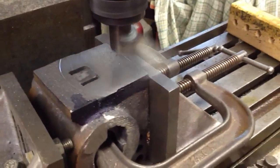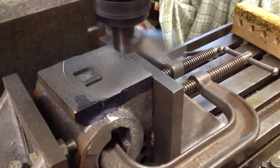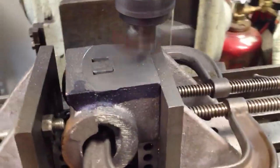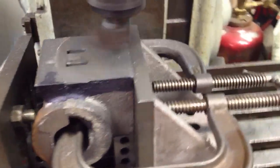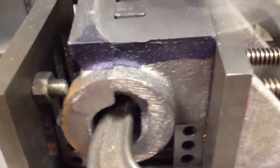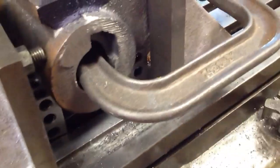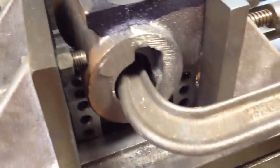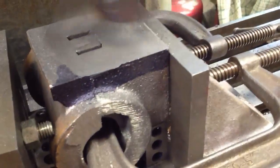I'm machining the top side of the cylinder. This is an Allen Models of Michigan cylinder casting, just mounted up, clamped on a block leveled up. C-clamp holding through the bore, using this other angle plate box just to hold it down so the cutter doesn't pick up the edge. Just a safety precaution.